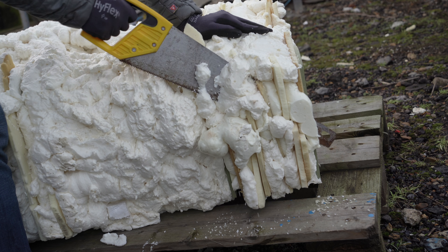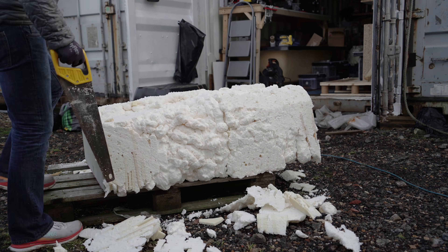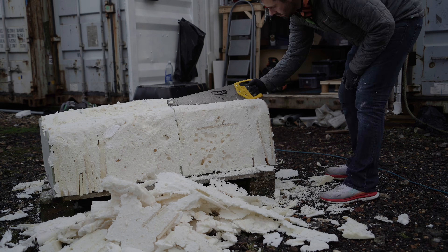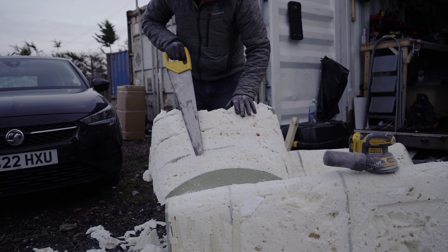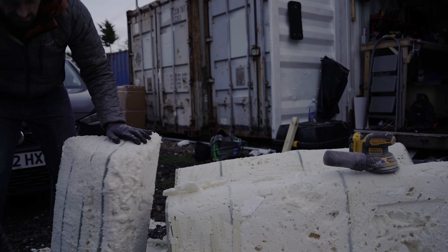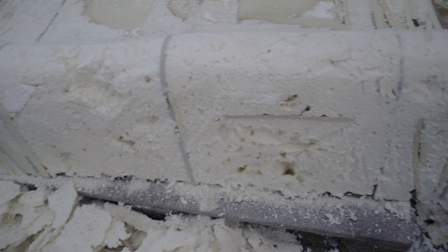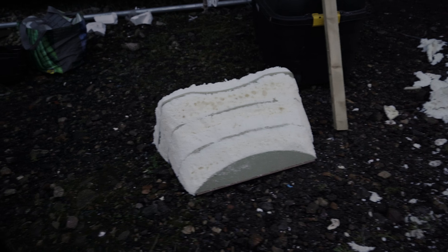All the basic cutting done — I'll save the scrap foam for a potential third round of recycling in some future project. Before long, without accidentally cutting away too much, I have something that looks more like the shape of an upturned shell of a one-third scale Bernard body. The nose needed to be made on another baseboard as the large one was too short, but that's fine — a little more manageable in fact. Using cheap moisture-cure expanding foam has downsides: there were air bubbles and actual voids despite careful slow spraying, meaning I had to go around the cured shape again with remedial foam spraying to minimise the undulations.